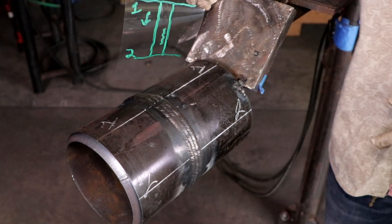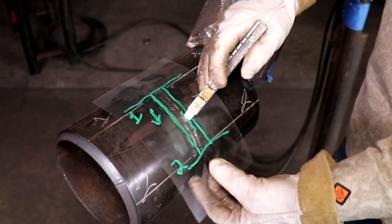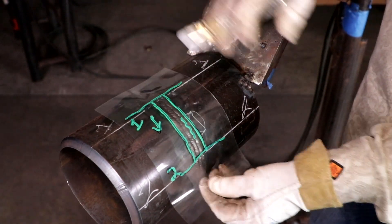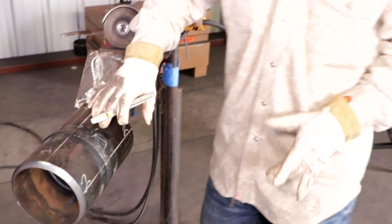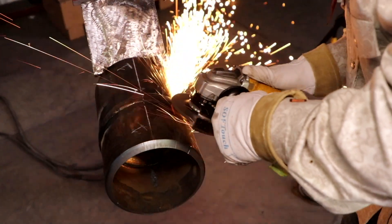Now I'm going to teach you how to tackle that. You're going to line up your one and two. I like to take a soapstone, a marker, whatever you have. Set it down and you want to mark out where your indication is going to be. Double check it. Then you're going to start taking your grinder to it. When you take your grinder to it, you want to make sure that you're leaving the bevels — you don't want to grind outside of the bevels. So I take my cap down flat with the grinder wheel going in this direction to keep just my cap going flat.